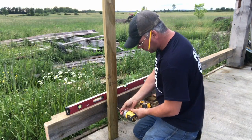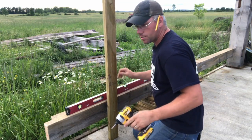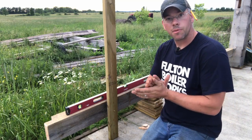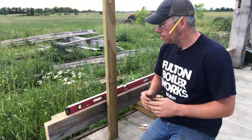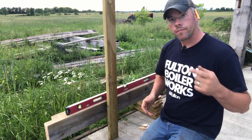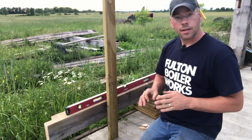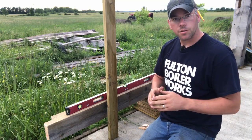You can't just trust your girts to get your level line across everything. It'll work really close - you could probably get it to within a quarter of an inch if you're taking your time. But confirm and back it up from your benchmark with your string level, laser level, or water level. I like to use the water level and string level in conjunction with each other.